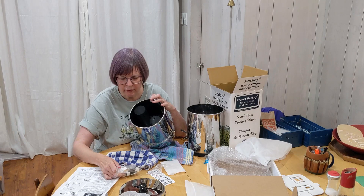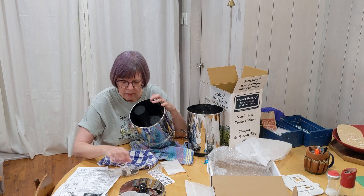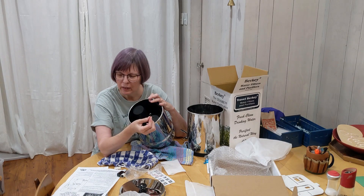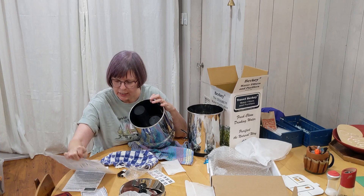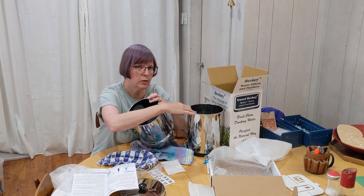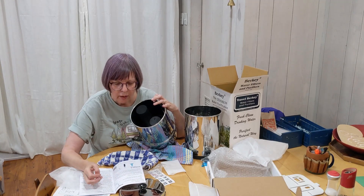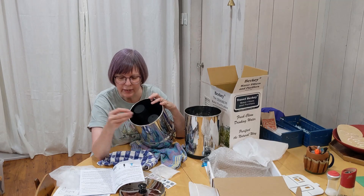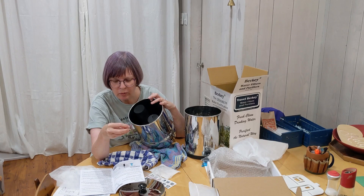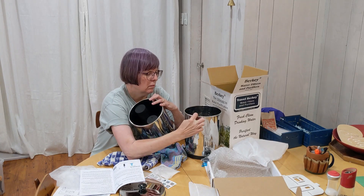There's a very small part included — a little teeny tiny J hook. The purpose of this little J hook is to keep suction from forming between the two tanks. This is called an anti-airlock clip. You snap it over the upper lip of the lower chamber with the lip side out, just like that. The purpose of the J clip is to prevent a suction section from forming.